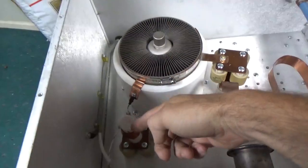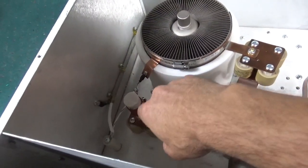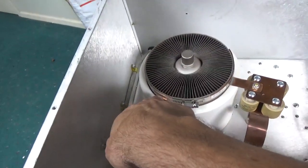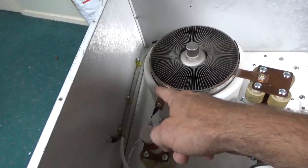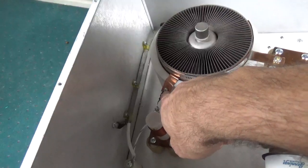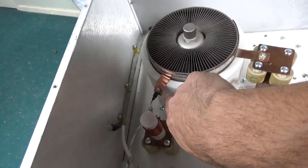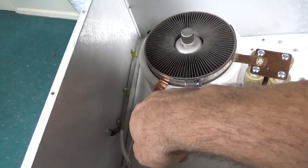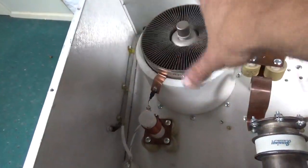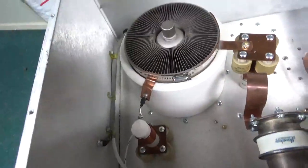I also changed the way it's connected and cut the ferrite down. This is number 16 wire. I put a strap between the anode and the strap, and I have a copper 6-32 screw on the other side, with a copper nut soldered to the strap. You need to put a split washer underneath the 6-32 screw. When he takes the tube out, this will separate — I just wanted to keep the lead length nice and short.